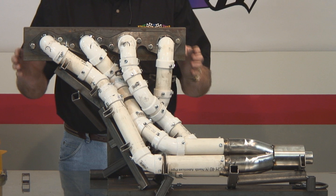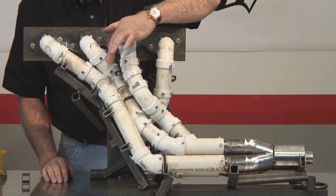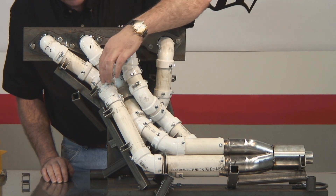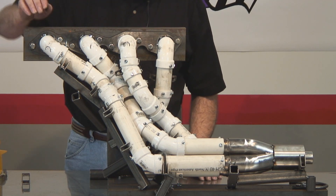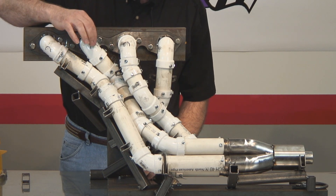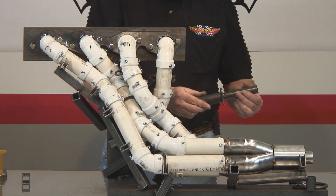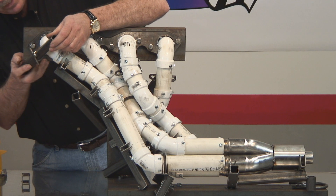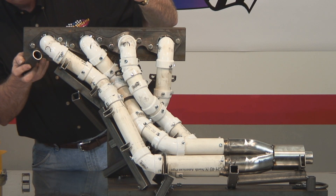The welding fixture is almost completed with just a few more items. These clamps have the PVC mock-up locked within the fixture. We're going to take a die grinder and nip these corners off so we can get the mock-up out. For tight spots — if we welded a tube across here to identify them, we wouldn't be able to get the mock-up out — so we use a little apparatus: it's a tube within a tube. It gets welded on, and then the inner tube is pulled out so we can get the mock-up out of the fixture.